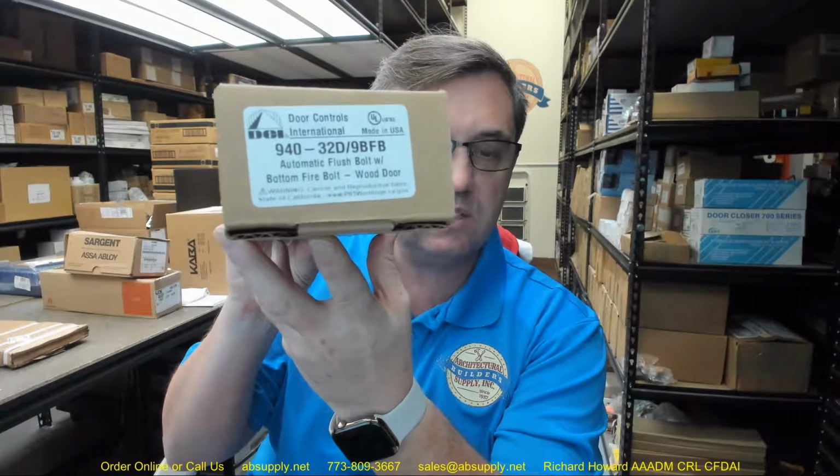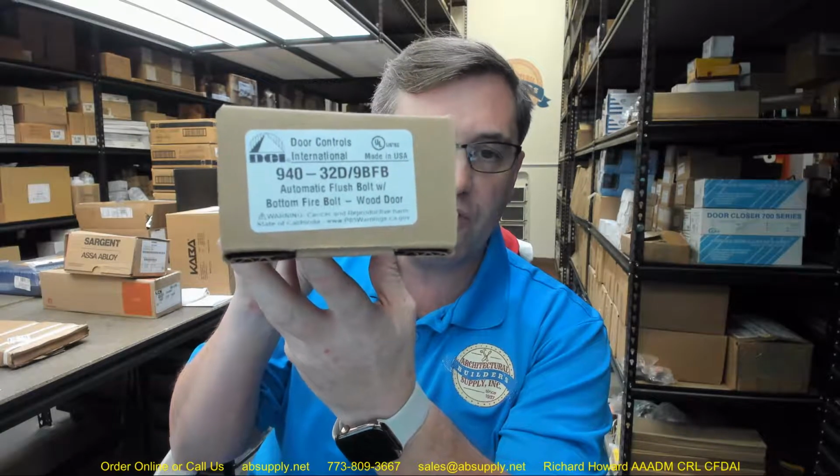This video is to bring you a closer look at the DCI number 940 in a 32D with a 9BFB. And this is an automatic flush bolt with a bottom fire bolt, BFB. This is intended for a wood door application, and this setup is specifically intended for a pair of fire-rated doors that you will see in a hospital.